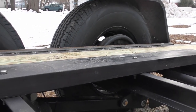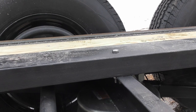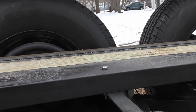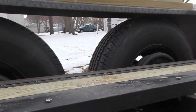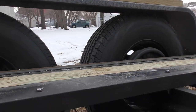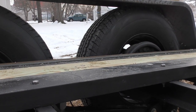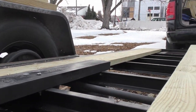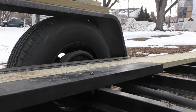So it helps absorb single axle issues. So if you run like a dual torsion, each axle has to take the brunt of the impacts, where the leaf spring with an equalizer, or the way I have this thing set up, helps to fix that problem. But at the same time, you can't have it attaching to the other side.